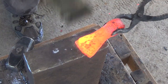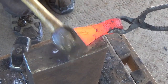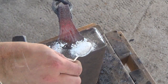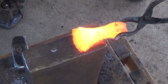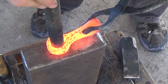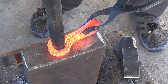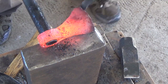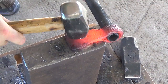Now that it's been welded together, I use a cross-peen hammer to start to expand the bit. Once the edge is expanded, I apply more flux, then bring it back and flatten everything out. Now that all the major shaping is done, I drive the three-quarter inch pipe into the eye of the axe and use it as a handle to finish it up — just straightening it out and making sure that everything is nice and finished.